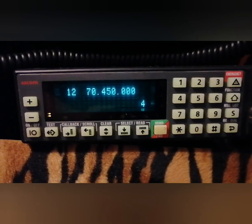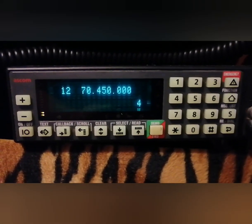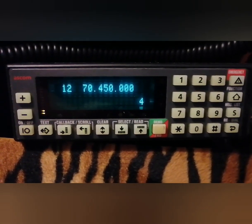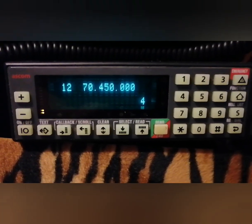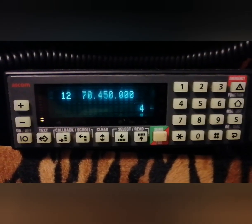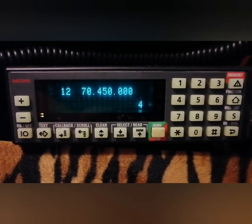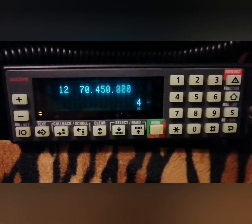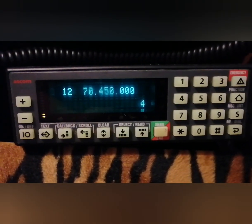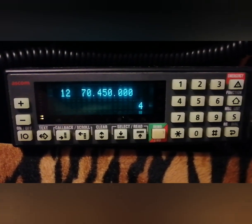In this video we're going to take a quick look at the 4-meter amateur band — 70 megs — and a portable antenna which can be used either on a hilltop or equally well as a home base antenna. At the moment there's not a lot out there for 4 meters: people are using Sirios 470 versions, the Moonraker 5/8th wave, and the very popular Ringo-style 5/8th wave antennas.